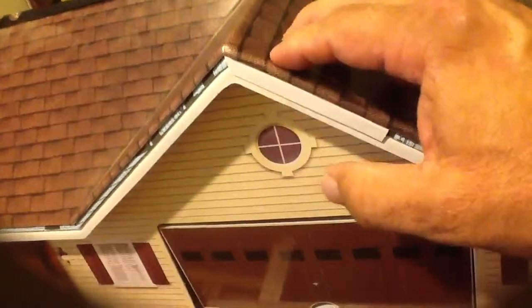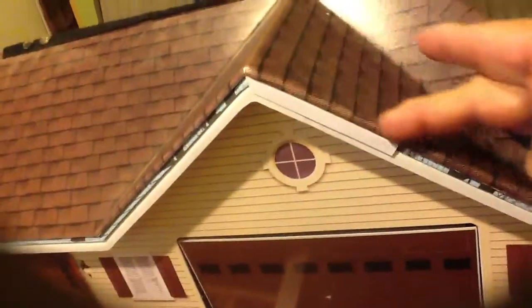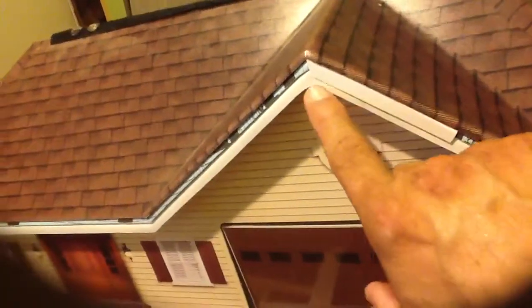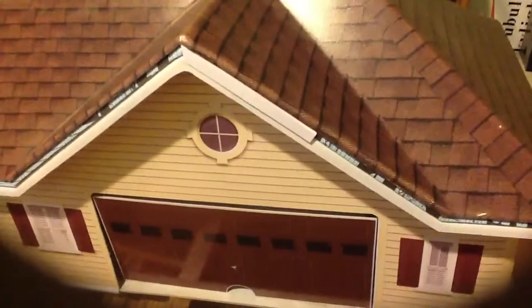Anyway, this is kind of what you end up with. You can see that the shingles cover the drip edge on the top. Moisture is running down here. Most of it's going to get in here, but if you have driving rain coming in this way, and if it forces it that way, it's onto the drip edge, onto the underlayment, and down and out. And any water rolling over the edge here, it's onto this drip edge here, onto the barge rafter or gable, or some guys call this a fascia. I call this a fascia. Anyway, that kind of gives you an idea of what we're talking about. Those drip edge metals come in typically 10 foot lengths, and whatever configuration you want, you can actually make them.